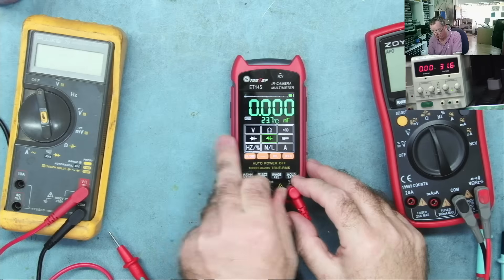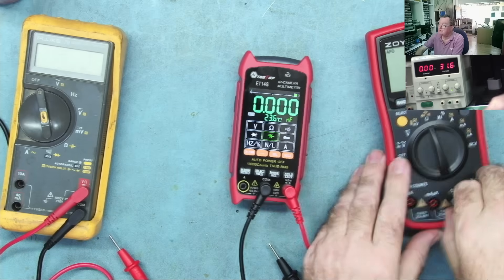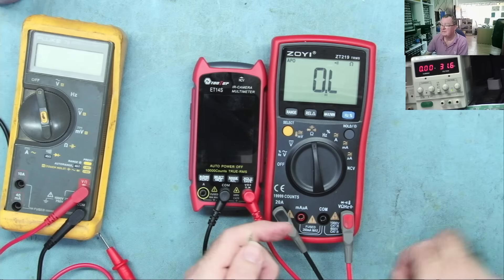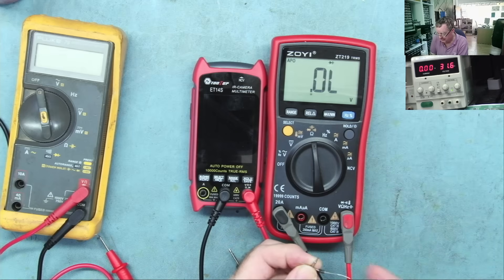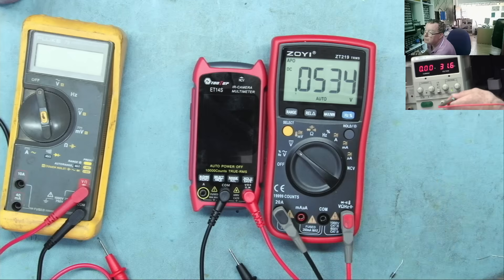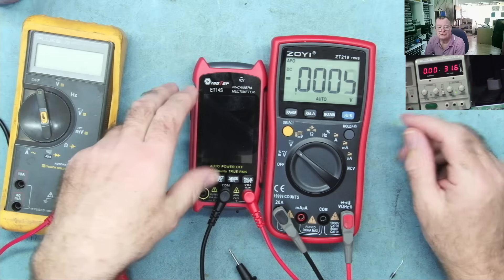Using that terminal, it doesn't really matter if you put the lead in the common or the amps input. That applies not only to this multimeter but to my other multimeter too — if I plug into the 20-amp input and go to ohms range, continuity works just fine, we can check a diode in continuity range and it doesn't act crazy like the other one. Diode mode is fine, a 10k resistor reads 10k, and volts AC or DC reads 31.6 volts. Why? Let's look at how the multimeter actually works.